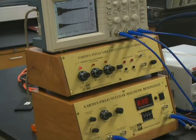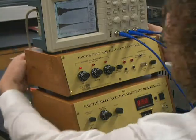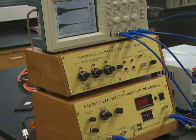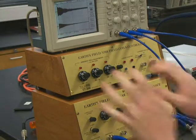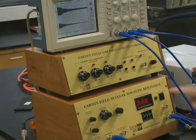We see a nice long decay. To initially tune and set this up, we're going to show you what it looks like without the Earth's Field NMR. I'm going to unplug the power from the back of that unit, which takes out the very small gradients in the X, Y, and Z direction that I've added to help balance or make the Earth's magnetic field more uniform. Now that I've removed those gradients, let's see how long our decay time is.